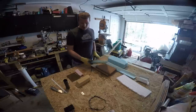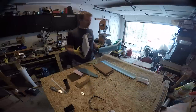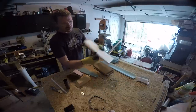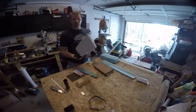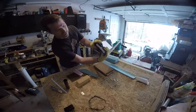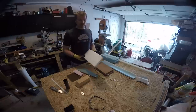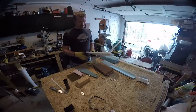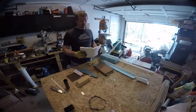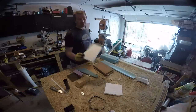Now let's talk about some of the basics. This is styrofoam — the stuff you're used to thinking about when you think about styrofoam. This is the kind that's made out of pellets. It's pretty friable — you can shred it with your fingers. It doesn't have a lot of strength; they make coffee cups out of it. It's a good insulator and waterproof, but really not very strong. I can flex it and crush it easily. Insulation is pretty much its only value, and I wouldn't use it for anything serious like a schoolie build.